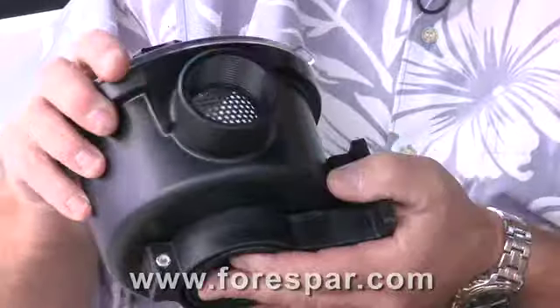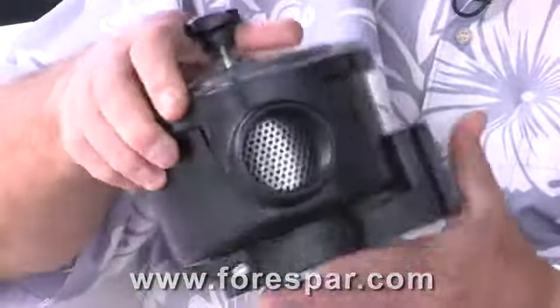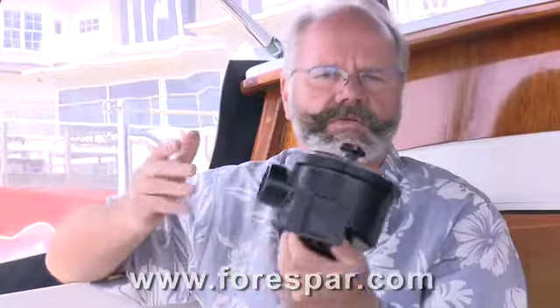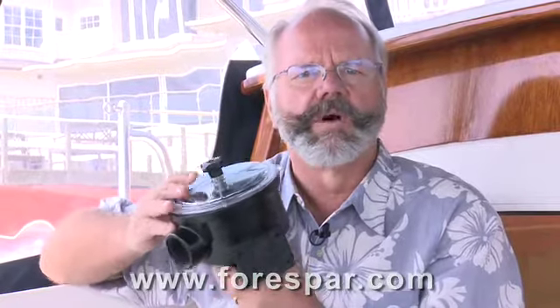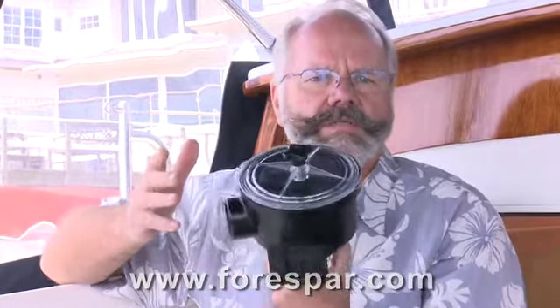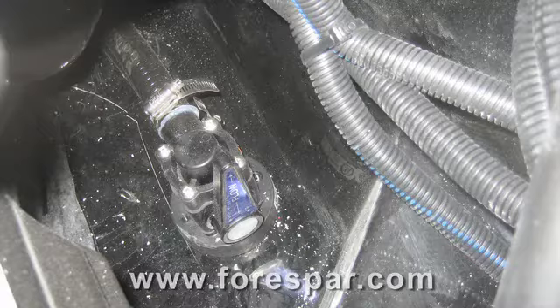The intake port is on the bottom and the exit port is on the side. The body of the strainer itself can be turned and rotated within the bracket so that it can fit in just about any direction for any kind of application. These bucket style water strainers should be mounted above water line if possible. This ensures that they will not flood if water siphons back into the line after the engine is shut down. Also, this type of strainer is designed to have water pulled through them, not pushed. They're not meant for a great deal of pressure, and for installations below water line, we recommend that proper valves be installed on both the pickup and the discharge sides of the strainer.